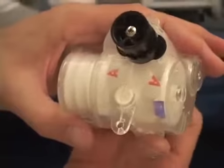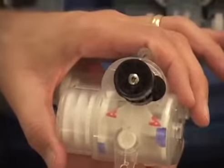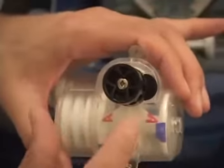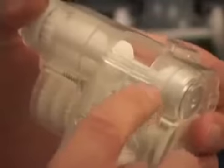As the cleaner cams move around to the pivots, you'll see the black pulley switch from going counterclockwise over to clockwise. This spot right here is where the pulley stops — this is our neutral position. As the pulley is in the neutral position, it's able to shift between this miter gear and this miter gear, and that's what changes the direction. This gear is always moving in the same direction, so we switch the pulley from one side to the other using these cams, which changes the output direction of the black pulley.